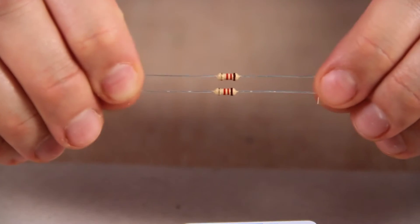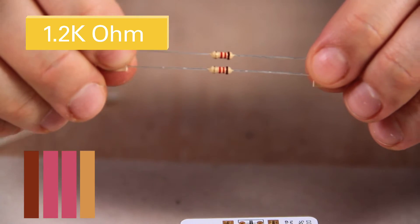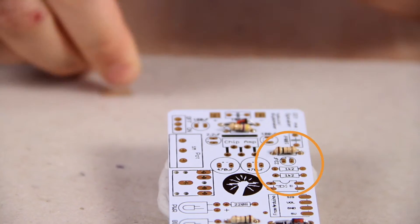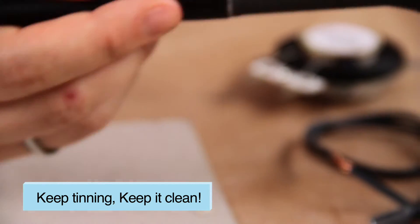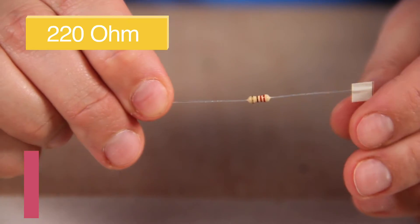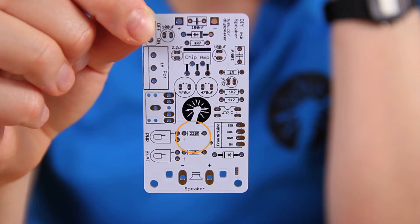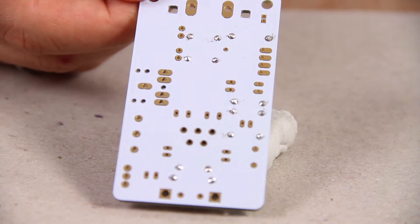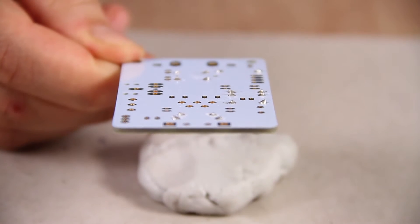Your next component is your 1.2K ohm resistor — this is brown, red, red, gold. Put this one into the 1K two slots side by side on the board. Your next resistor is your 220 ohm resistor — the red, red, brown, gold resistor — which goes right here where it says 220R. All our soldering joints have the minimal amount of solder on them, just a little mountain shape, quite flat on the board — just enough solder to secure the component in place.